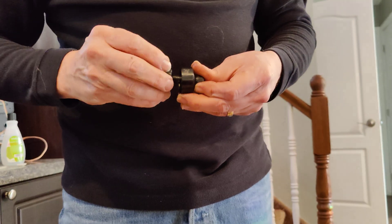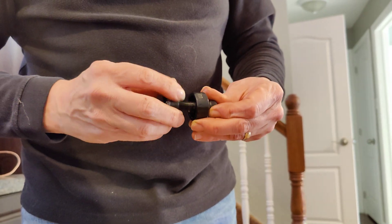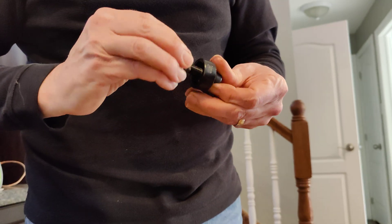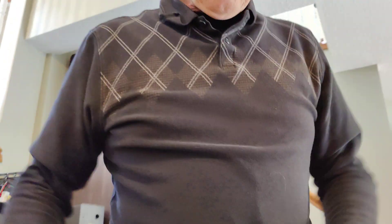So there you go — very handy tool for creating metric holes. This is a 24mm punch that I purchased on Amazon for about $15 Canadian. And it very much does the trick. Much easier than trying to use a great big chonky bit to drill the holes. I have also used stepped drills in the past — they can work — but this is a whole heck of a lot easier. I thought I'd share that with you in case anybody found it helpful. Have yourself a good day.